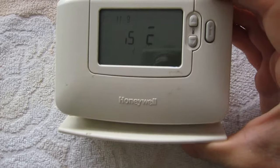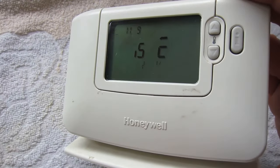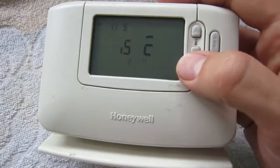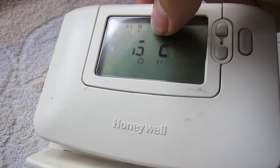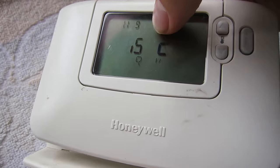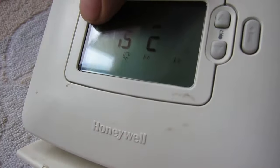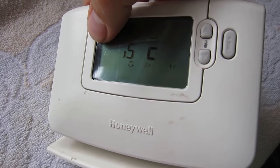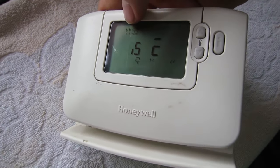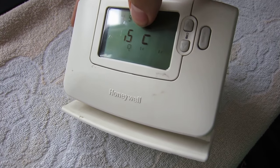I've decided to not illuminate all of the characters on the LCD display, so you can see that it's 20-something in here, and the two are still partially visible, as is the date. If you just touch the display slightly, the side of the 5 there comes and goes. I think the interface to the edge of the display has been thermally cycled too much, and some of the contacts are broken.